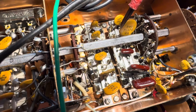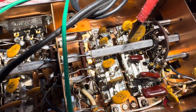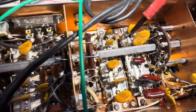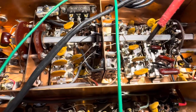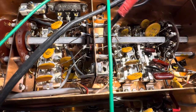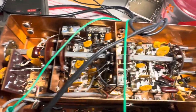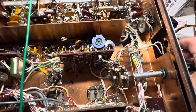I could probably put a cap on the bottom here and run it that way as a bush fix — I may do that because I don't want to take it all apart. I cleaned this stuff out with Deoxit and all these rows seemed to clean up. I'm not sure why that shorted, but I don't think I'll be taking it all apart — it's not worth it. So that's my story on this R4B. We'll see if it turns out to be a really good radio. Right now it's a working radio, a work in progress.